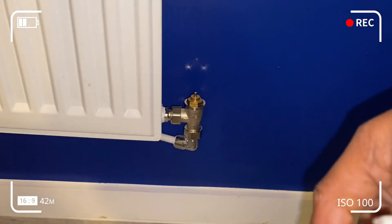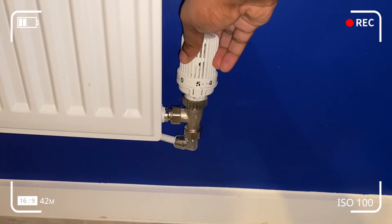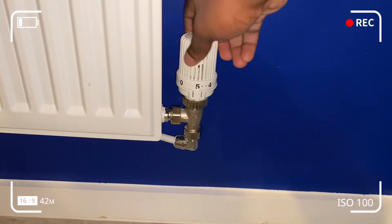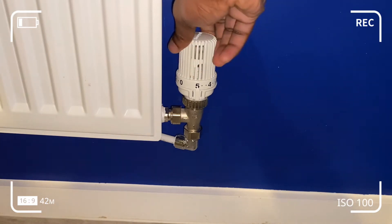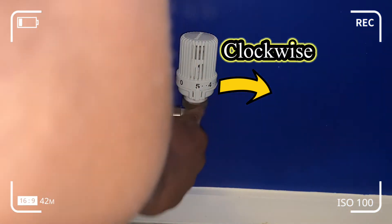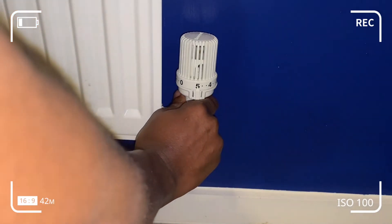But sometimes you've got the other head around the locking ring that looks like an umbrella — if you've got that type of head you'd need to rotate it slightly clockwise until it feels like it's fitted into a slot, as I'm doing here. This one doesn't require that; you can fit it directly due to the design, and then rotate the locking ring clockwise to secure the head.